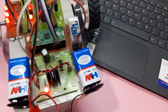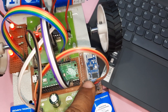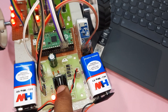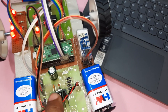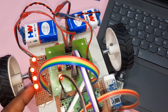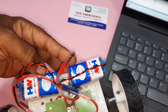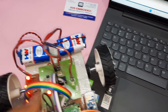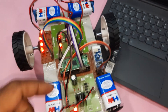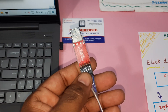Two batteries are used for the power supply board, Raspberry Pi Pico board, and Zigbee module. These two batteries are connected to a bridge rectifier, filter capacitor, and 7805 voltage regulator, giving a 5-volt output. That 5 volts is supplied to the Zigbee module, Raspberry Pi Pico board, and LEDs. The L293D driver IC is connected to the Pico board, and two separate batteries operate the two DC motors for movement. So in total there are four batteries: two for motors and two for the power supply section.